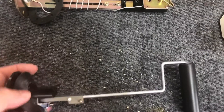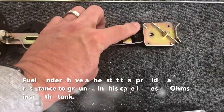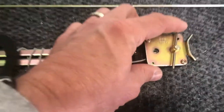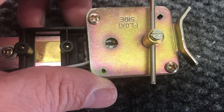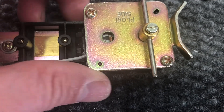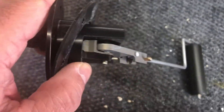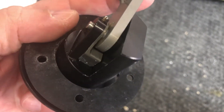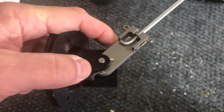The way this CIES mechanism works compared to the old one: the old one is a resistor or ohm-type unit where contacts get made inside the unit itself to determine the fuel level. The CIES one doesn't have anything like that — it uses a magnet of some sort to judge the amount of fuel. I'll include links in this video to their site.